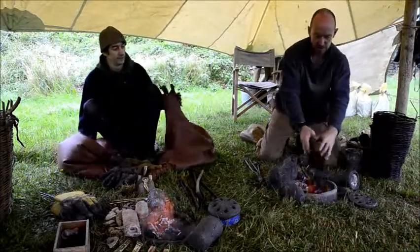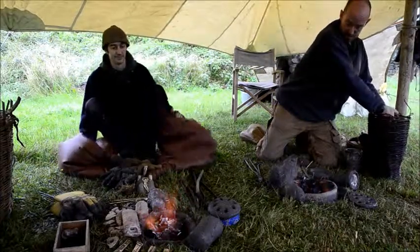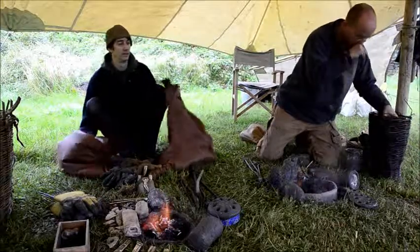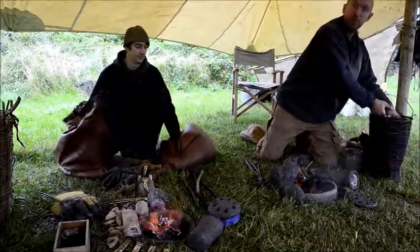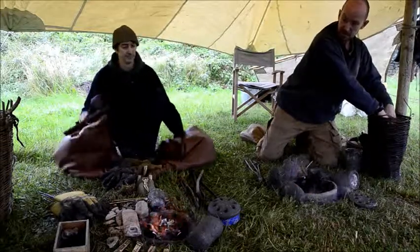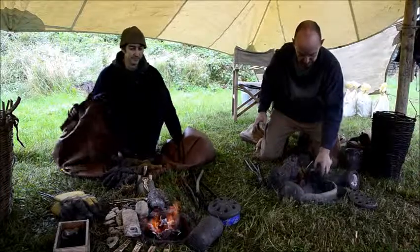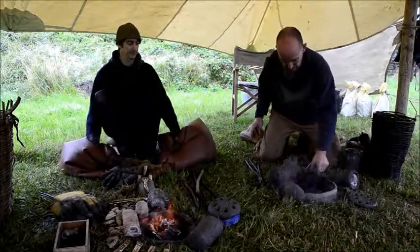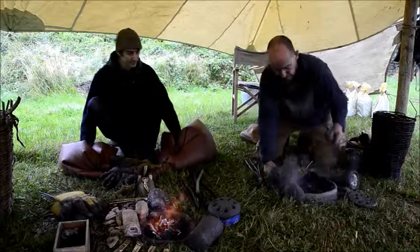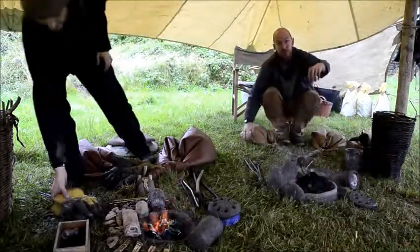It's still about 20 minutes away from the casting. I'm only heating the bronze up to a temperature of about 1050 to 1100 degrees centigrade in here. There's a little pot inside the furnace and the charcoal surrounding it, and the air brings it up to a temperature of about 1200 degrees.